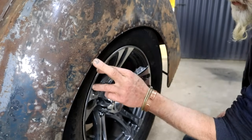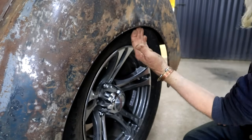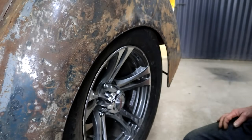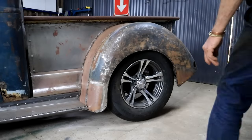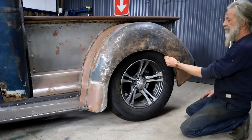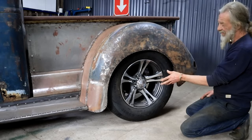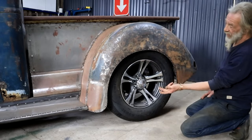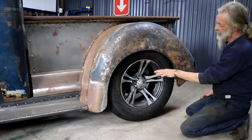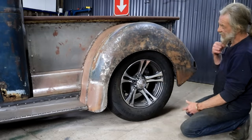I'm not going to grind off these tacks yet because when I do there will be very little weld material left. So when I take this off I want to tack it a little bit from the inside as well, and then only will I grind these tack welds. So we've taken care of the practical aspects - my edge on the wheel arch is reinforced, I can get my wheel out. If I want to change wheels or I get a flat, we're currently at maximum ride height. If I jack the frame up, the wheel drops down a little bit more and I can get it out.